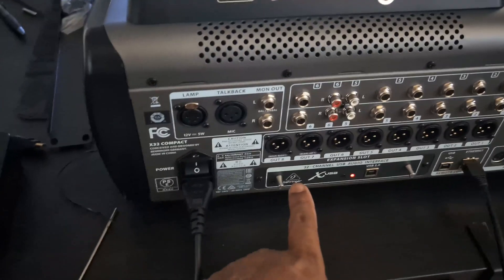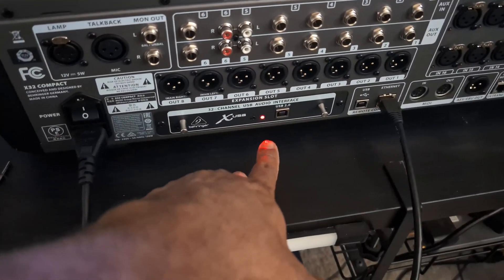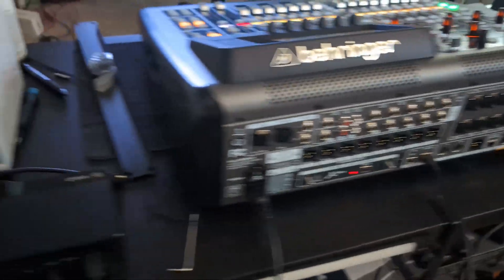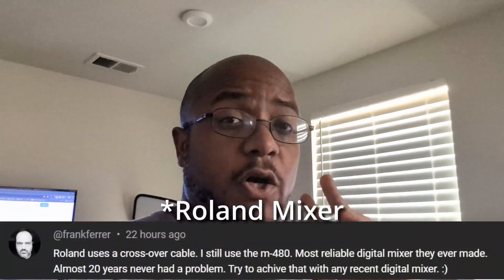I do have cables to connect the computer over USB — that just avoids any noise and all that stuff. I think we're going to be good. We have a good setup for when I take this down to the church. I didn't get the shielded etherCON cable, and the Personas uses a crossover cable — that's why it was crossed when I did a test. So I'm going to have to re-terminate that to a regular traditional ethernet termination so this can be connected to it.